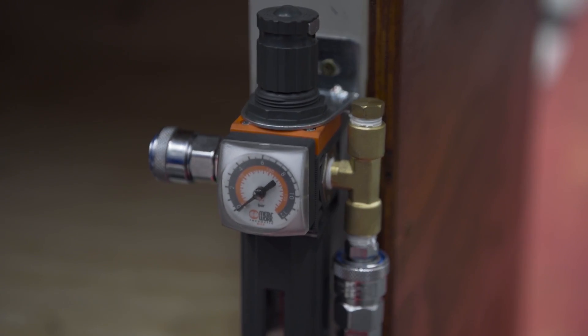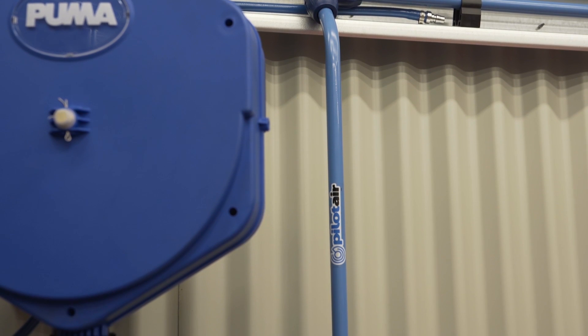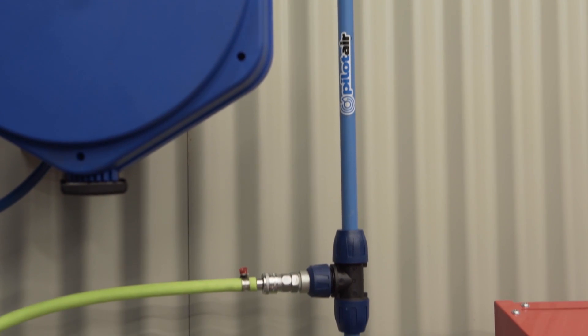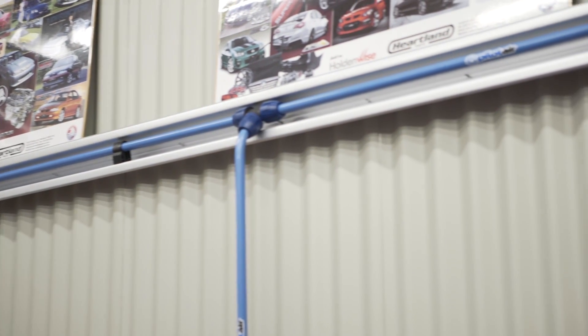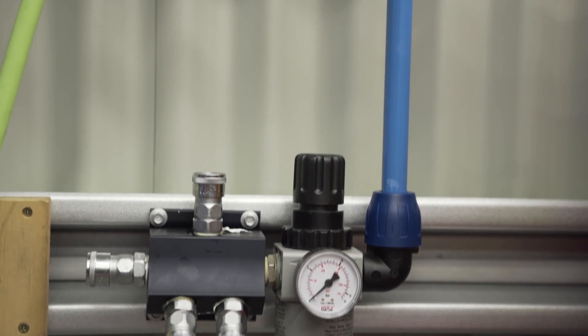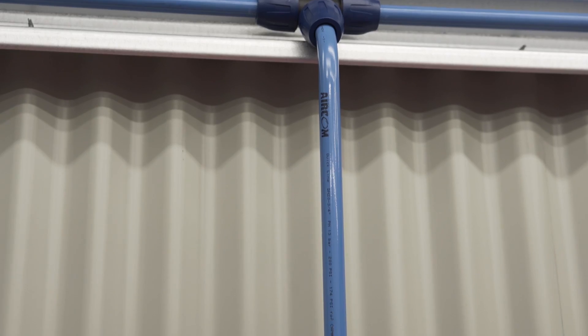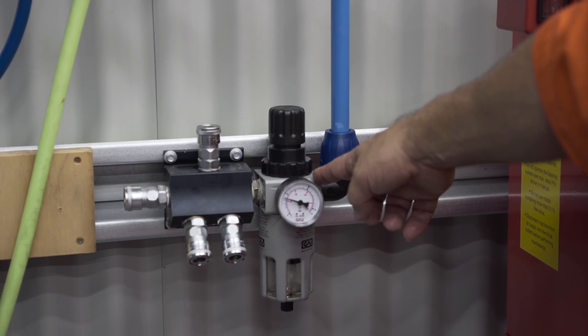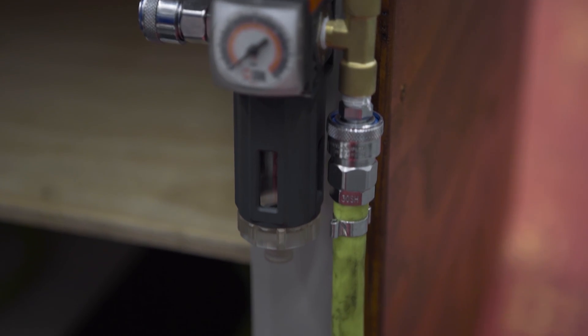The best system of all is the pilot air delivery system. The air travels all the way around aluminium piping, which actually keeps the air cooler. You can drop these lines anywhere in your shed and have them custom fitted to what you require. With this system, it enables you to add filter regulators at all the outlets, just like we've done in this shed in all four positions.